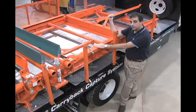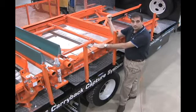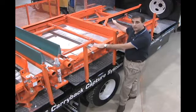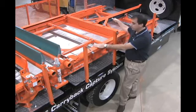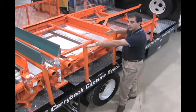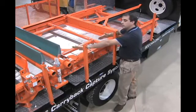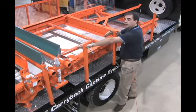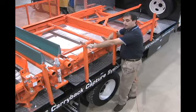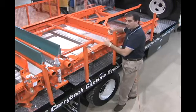It's powered by a 230/460 volt three-phase motor that runs a hydraulic cylinder rated at 3,000 PSI. This particular cylinder has a four-foot stroke, and it moves the rams forward, pushing material out to the end. When it reaches the end, a stop is set at 1,600 PSI, and at that point it automatically retracts.